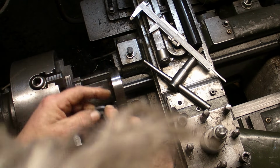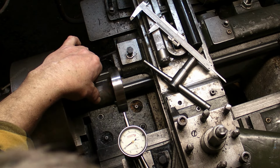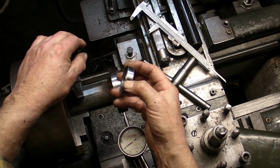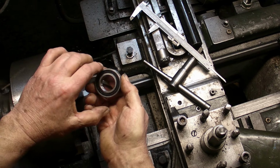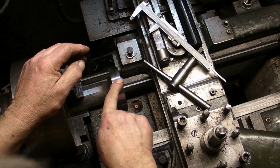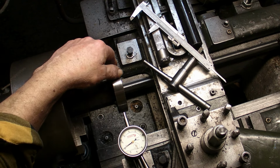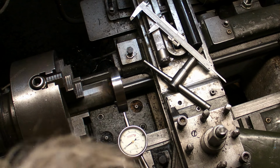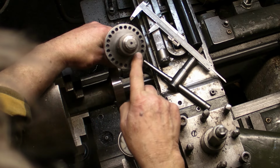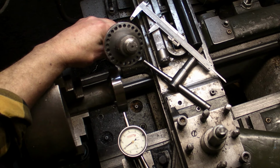The only trouble was that the tubing that I'm using for the main housing, there isn't sufficient wall to bore that out for the 47. So on this side I'd already fitted a collet on which will mate up to this section. I've drilled 24 indexing holes with 6mm.